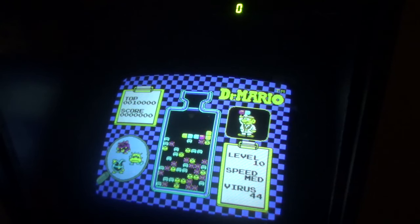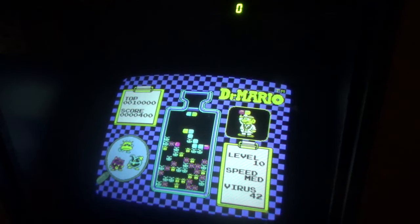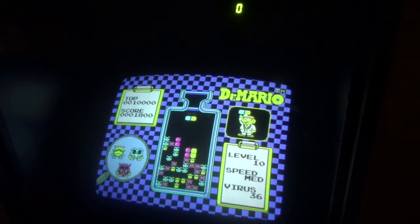it'd been a little while and I was talking to Ronnie at that point and I said, yeah, Shane thinks it's RAM 2K. And you know what he said? Shane's probably watching this too. Here's what he said, Shane. I said, yeah, Shane thinks it's 2K. And Ronnie starts looking at the schematics. And he's like, yeah, that's kind of what I was thinking. I kind of figured that's what it was, at 2K. So sure enough, we put a new RAM in 2K. And it seems to be working just fine.